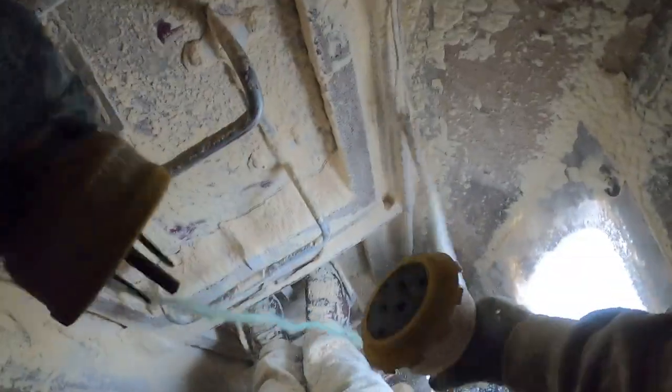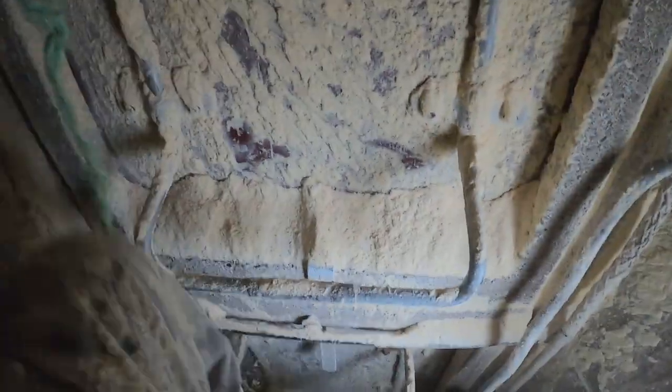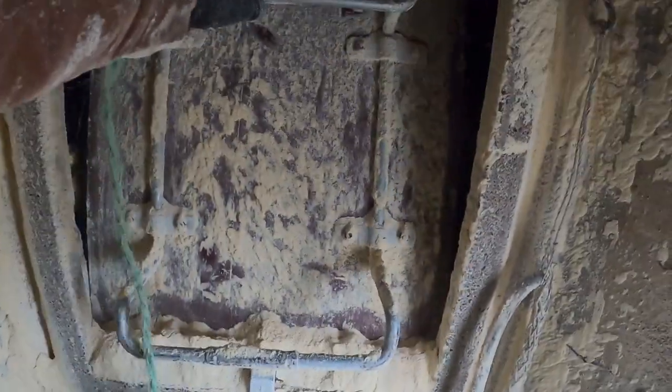Gonna disconnect the spout from the wall, unchain it, and I'm also gonna unchain the unloader from the wall. I'm gonna disconnect my power. I have to disconnect everything because I'm gonna be leapfrogging with these doors. Pop a door out, put it above itself, and then bring the spout and power with me to the next door down. And I'll just repeat the process for the next door.